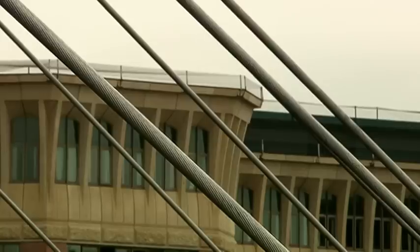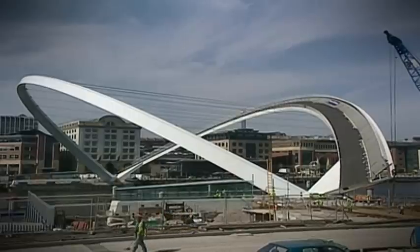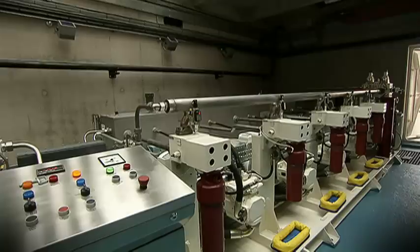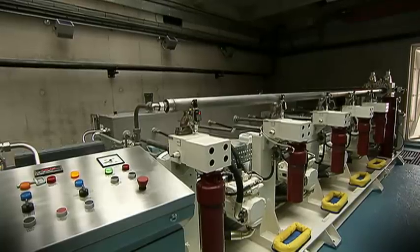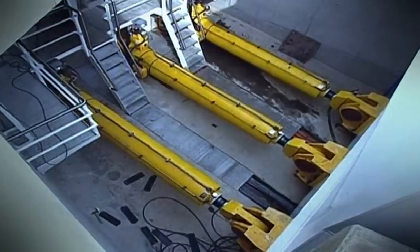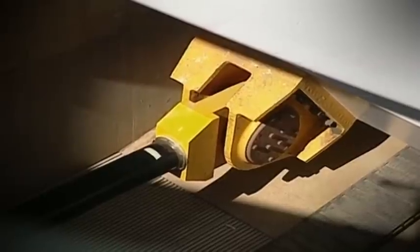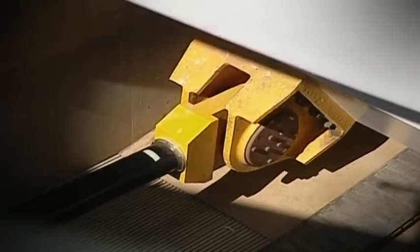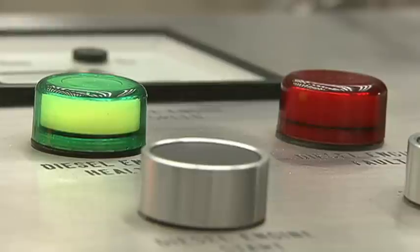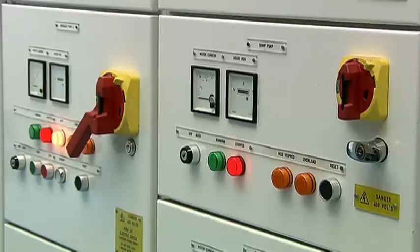A very carefully engineered piece to make sure that the deck and the arch stay in the same relationship to each other, so it's actually remaining in balance when it's tilted. The bridge is powered by hydraulic rams which push and when they push they tilt the bridge. Three 55-kilowatt hydraulic pumps on each side of the structure help to create the tilting motion and are controlled by a sophisticated computer system to ensure that synchronization of the ram extension is precise within 10 millimeters between each side of the bridge.